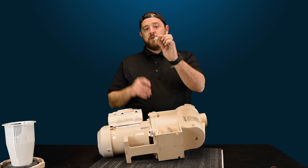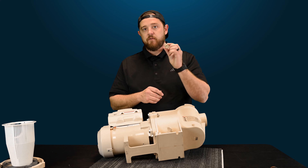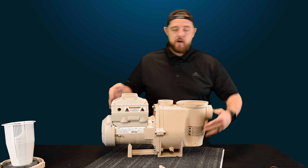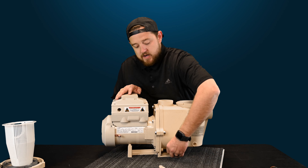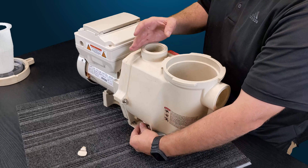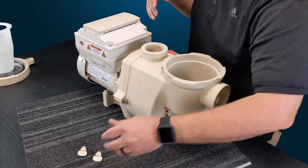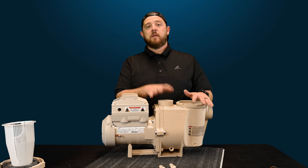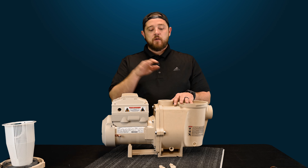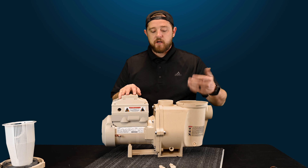You can buy these complete with a new O-ring, so if you've lost them or they broke, check out the links in the description — we'll have these available for you guys. Make sure you remove both of them. At that point you're going to start to see the water drain out. And on the back plug, it will drain from the inside where you won't be able to see it because you'll have your pipe coming out. If you have it unionized and plan on taking the whole pump out, you don't need to worry about pulling the drain plugs. But if you leave everything attached at the equipment, it's really important that you pull both to get all that water out so you don't have to worry about it expanding when it starts to freeze.